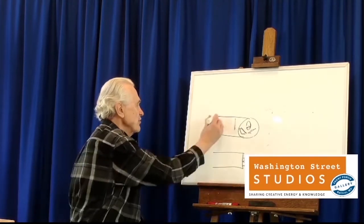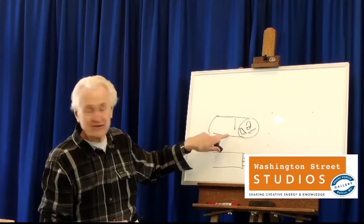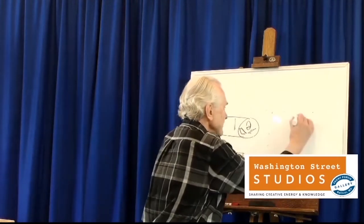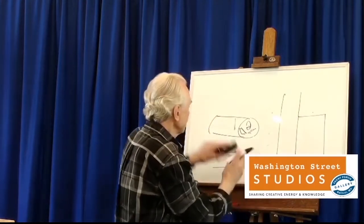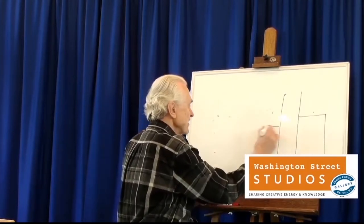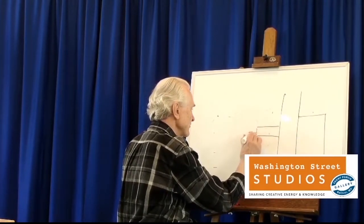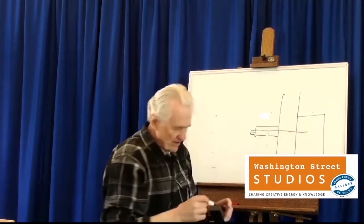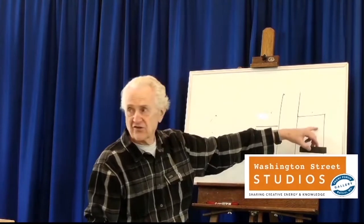Also, look at the condition of the ceramic tube that's sticking through the wall. Is it cracked or corroded? Is it in good shape? On the other end, if I diagram just the kiln sitter, let's say here's the wall of the kiln, and this is the control box for the kiln sitter sitting on the outside, and then the ceramic tube comes through like this, and there's the rod. On the outside of the kiln, this rod continues all the way through, and this is where your switch is. Look at the controls out here and make sure that the switch works.